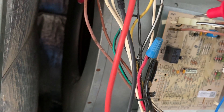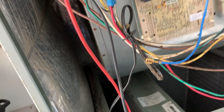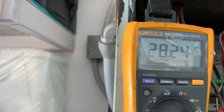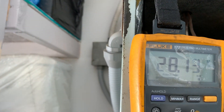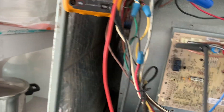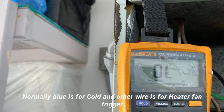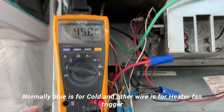I'm going to measure very carefully with one hand. I'm touching the probes right now and I can see 28.3 volts. Since my blue wire is tapped to the bottom connector, I see 25.3 volts — close to 30 volts. Anywhere between 25 to 30 volt AC means the board is working. Now I'm going to turn off the thermostat and measure again to make sure there is no voltage present.